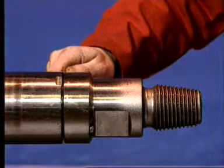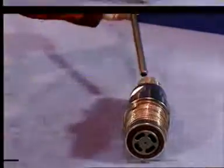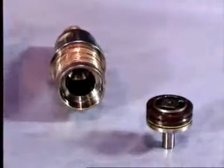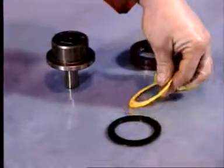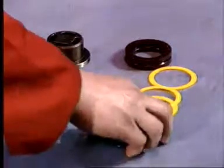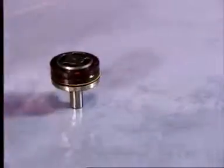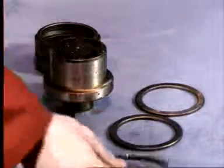Measure the gap between the top adapter and the cylinder. Compare it to the minimum and maximum makeup gap in the manual. Now, remove the top adapter, non-return valve housing and makeup assembly from the cylinder. Adjust the total thickness of plastic or steel shims to ensure the correct makeup gap and then reassemble. On the models with steel shims, ensure that the makeup spring has been assembled in the same order as when it was taken out of the hammer.